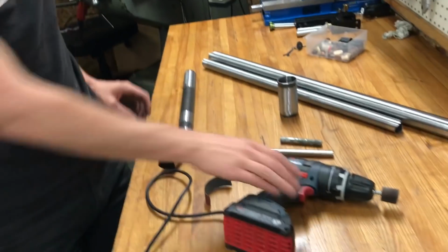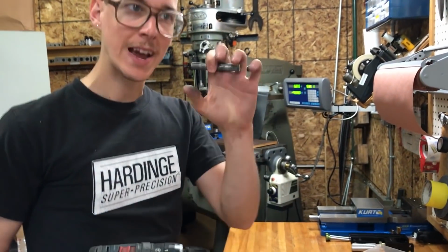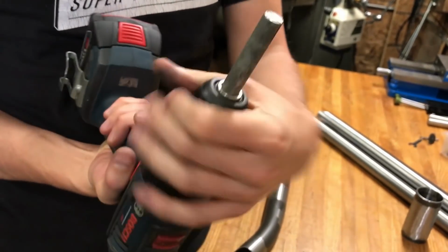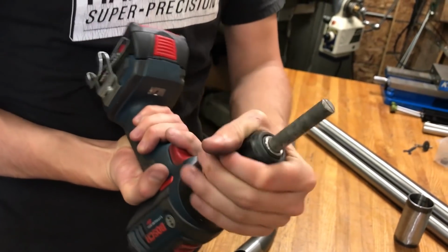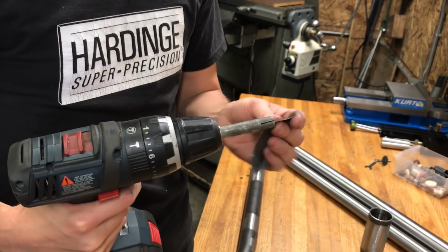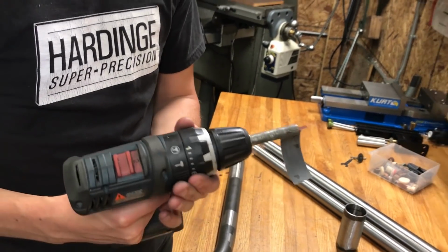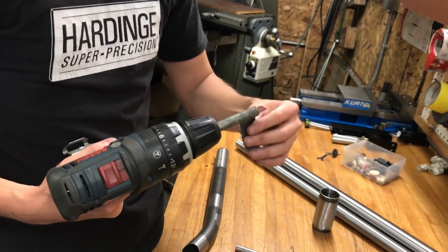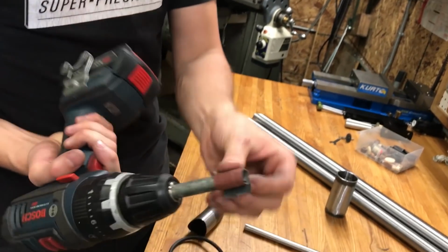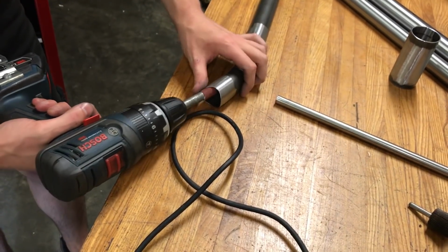But there's more. There's different ways you can do that sort of thing. This is something I heard about a long time ago. Somebody was calling this a wind-up. But this is just a 1/2 inch shaft, I think this was originally like a bolt or something, and you just hacksaw a slot in the end of it. Anybody can make one of these. And then you put in a piece of emery cloth, and you gotta be careful with this kind of stuff because once it's got a lot of grip, you can grab your finger in it or something. You can do a longer strip, makes a larger diameter sort of drum, and then you just spin it around in here.